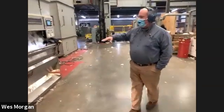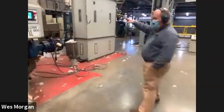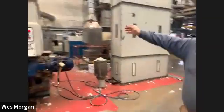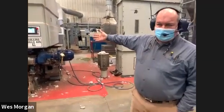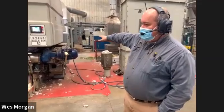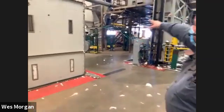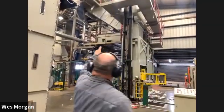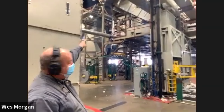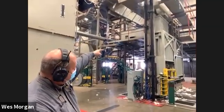After the cotton goes out of the back of here, it'll go to 2 more machines called lint cleaners. Now that we've got just the cotton, it'll clean up just the fiber itself. Then it's going to go out the back of there, and the cotton's going to get carried all the way up next to the ceiling here. It's hard to see probably on the camera, but that's an inclined board, a sliding board, so that cotton will slide down into the bale press.